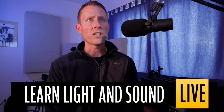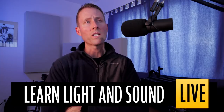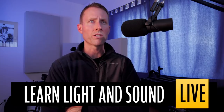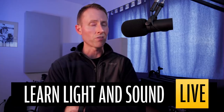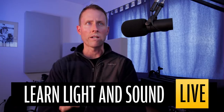Do you know how to sync, jam sync, a Panasonic EVA1 with Tentacle Syncs? I think the answer is you'll want to keep the time code generator connected. I haven't used the EVA1 in particular, but it should have a proper time code input, because it is basically meant to be a cinema camera. So I don't think you want to jam sync it. I think you want to connect the time code generator and leave it on there.